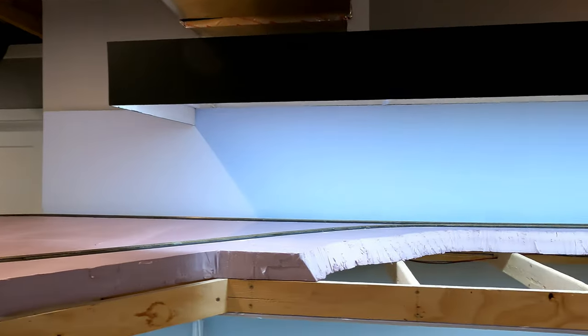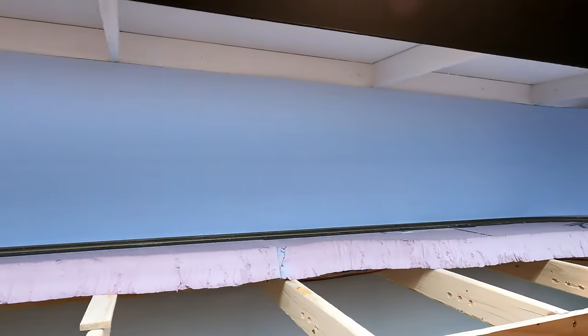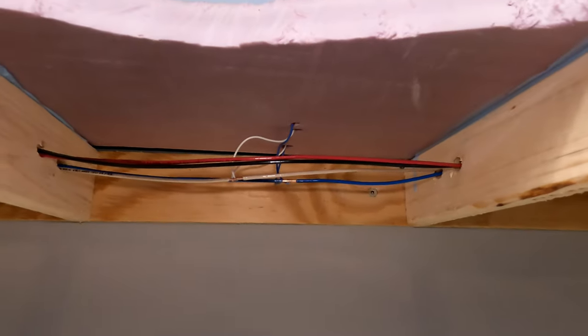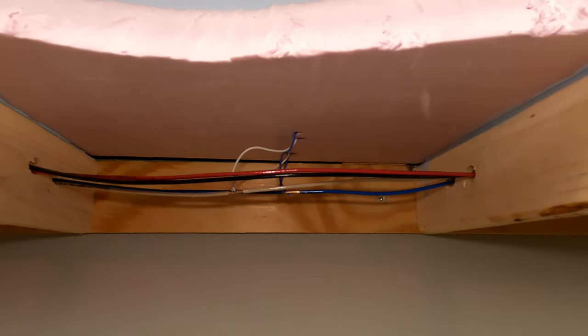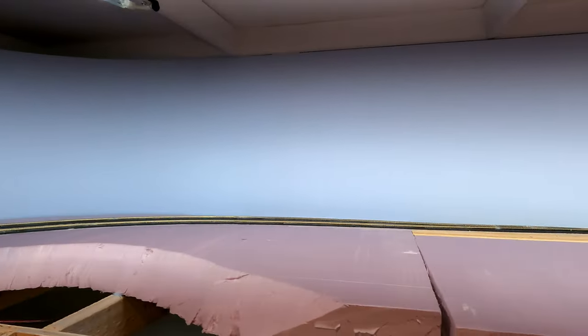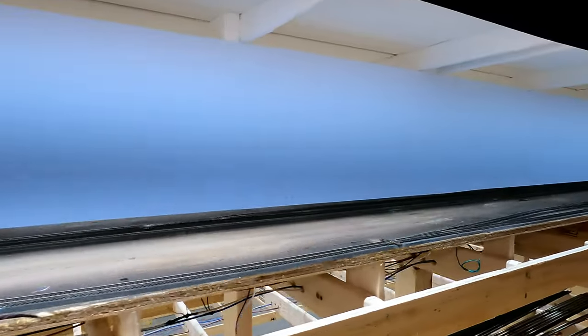There's an ops code that you have to send to whichever power sub-district you want to configure for auto-reversing. Let's take the metal spray cans off the track because they will short out the track. Take those off and then we can turn track power back on and try configuring this actual reversing loop track section. All of the track is now wired in place, glued in place. I'm going to go on a little bit of an adventure. I haven't actually soldered into the DCC bus or covered with liquid tape yet, but basically every other section of track on that return loop is somewhat wired in place — loosely wrapped, but enough that it conducts. I've got the right resistance and stuff like that.